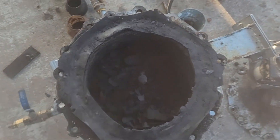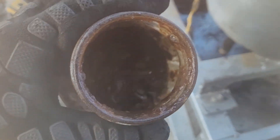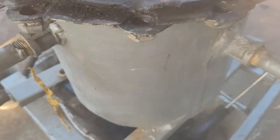That happens with everything, so I don't see it as a problem with the pyrolysis as much as a problem with this reactor. Hopefully in our next reactor, when we do have a proper agitator, that won't be the case. Of the areas that were in contact with microwaves, really nice and even carbonization all the way around. So that's what happens when you pyrolyze wood chips: you get a decent amount of gas, you get a lot of water, and you get some oil slash tar. I compressed the gas from the yoga ball and it got the tank up to about 40 psi.